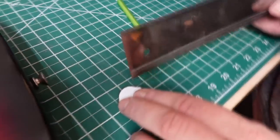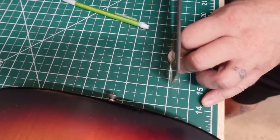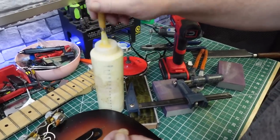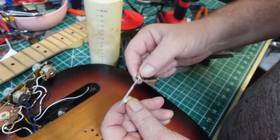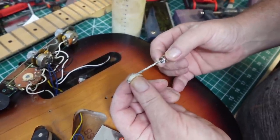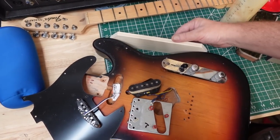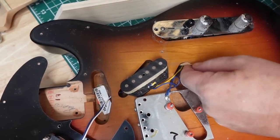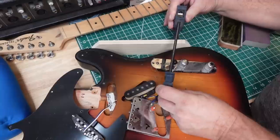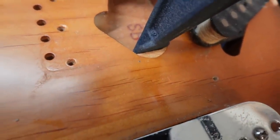Looks good enough to me. I only need a sliver of this — if you remember, it was just not even a sixteenth of an inch at the hole. I'm going to dip it around here — yeah, we don't need much. That's good old Titebond wood glue — link in the description. I'm going to put this here to give me a flat surface to clamp to, put my little wedge in here, and just clamp it as tight as I can get it. Yeah, that's gonna be fine but we need to let it sit for about 20-30 minutes.